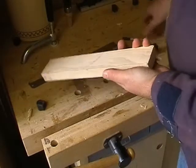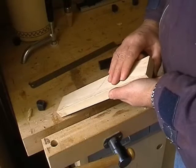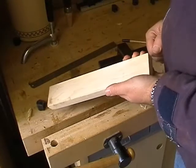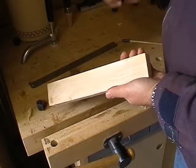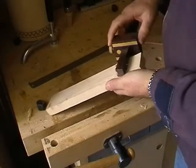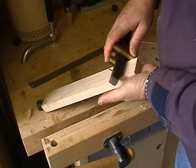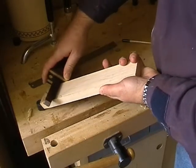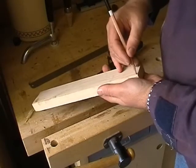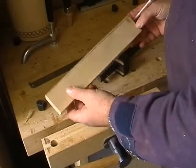My old age means I need to put a pencil mark on it. On one side is fine, but I actually need it on both. To turn the wood over, it's important that the wood gets turned over that way. Going in against that mark there — face side — same thing again. Gauge it, lift it up just a wee bit so the gauge can go past, then run the pencil down it. That shows me where I'm working to.